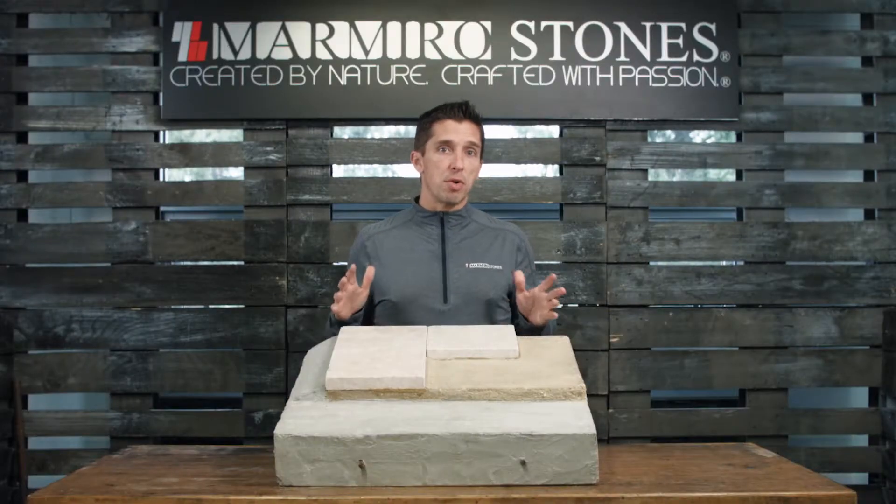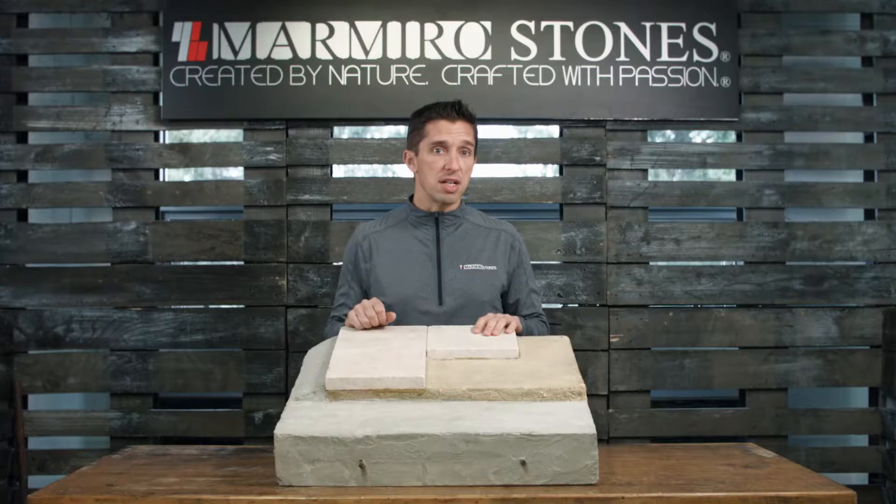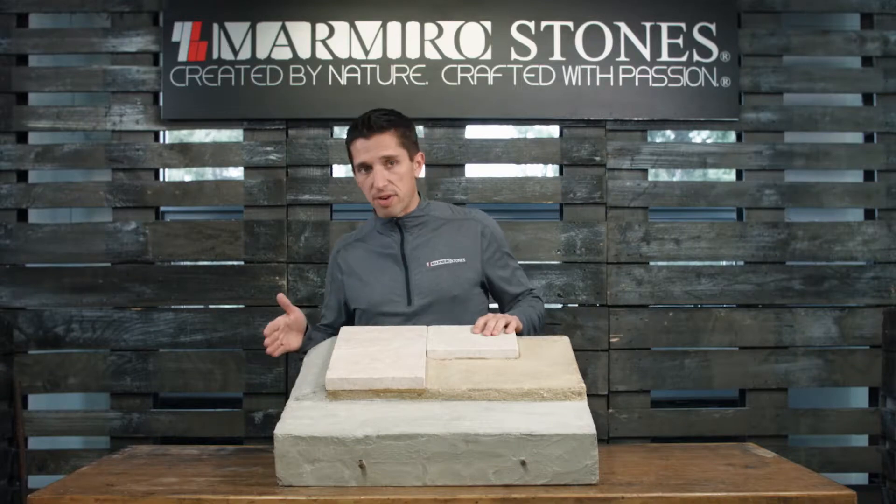This system is composed of a sub base and a base, so your excavation depth for a vehicular application will be between 12 to 16 inches, and this will vary based on your soil type and climate. Make sure that you extend that excavated area 3 to 4 inches past your outside edge — this will be for your edge restraint.